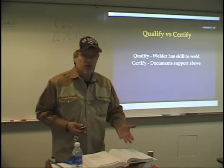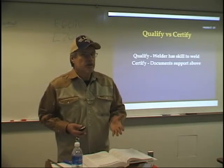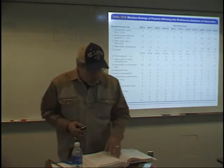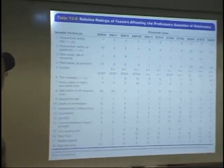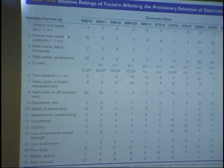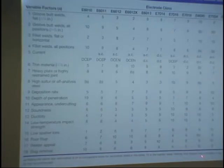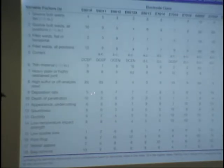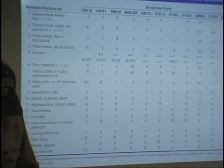Specifications and service conditions — probably next to the base metal — put a bullet here. Service conditions are probably the most important thing. Table 12-8: if you look at 6010, groove butt welds — rating is on a comparative basis, 10 is the highest value. 6010 is best for groove welds, it's got a 10. Come over to 7018 — groove butt joints: 7018 has a 9 rating. It's a little harder to weld on groove butts because of the slag it produces. There will probably be a question or two coming off that table.